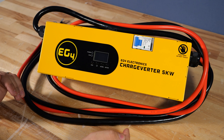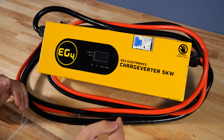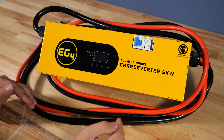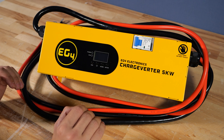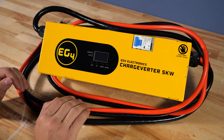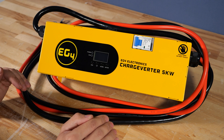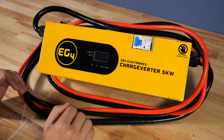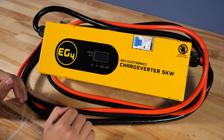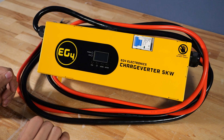The Chargeverter really takes your system to the next level. Normally, for off-grid systems, you need good, clean power from a pretty large generator to feed through the inverters to your loads, so that way when the inverters are in charge mode, they don't overload the generator. The Chargeverter brings a unique new aspect to this, because instead of trying to pass through potentially dirty power, you can simply turn it into DC power and then let your inverters — that output a very clean sine wave — do their job, and you never get that dirty power feeding through. You never have to worry about transfers back and forth from generator to inverter. This really can save you quite a bit of money on your off-grid system, because instead of spending all the money on a large generator with clean power, you can use less expensive generators and just feed it through a Chargeverter.